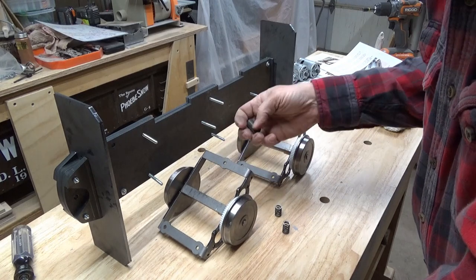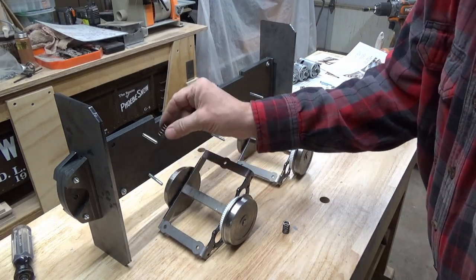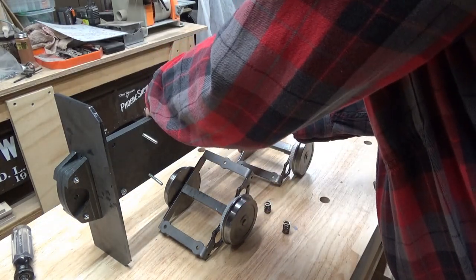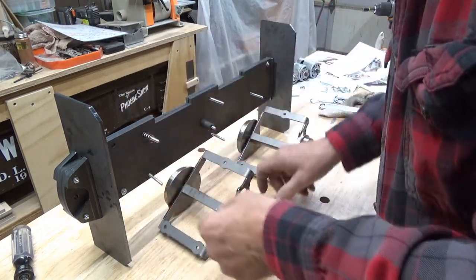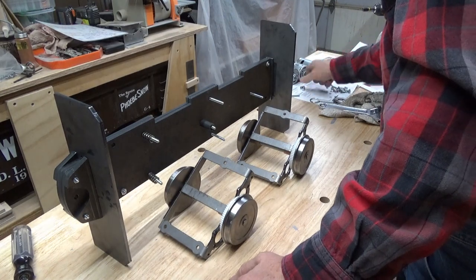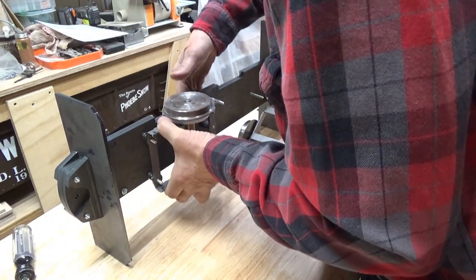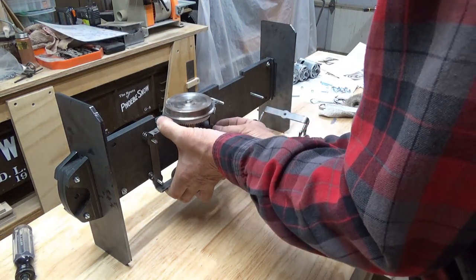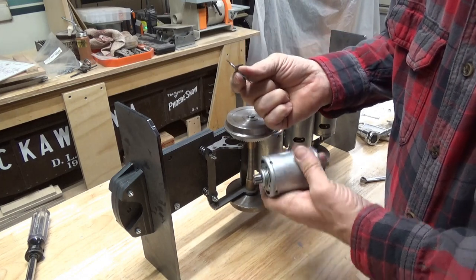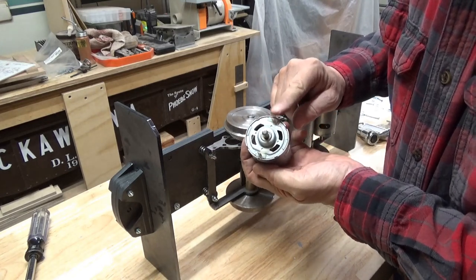Time to attach the wheel set frames. It looks like a three-point suspension — there's a bit of rubber tubing on the center and then two springs on the lateral parts of the triangle. We want the Delrin gear positioned on the notch. Next, we'll take our three bolts, a spacer, and get these motors all mounted. There's a little polarity red dot — I'm going to keep those oriented all the same to help me out later when I attach the wires.